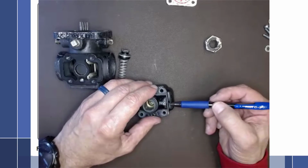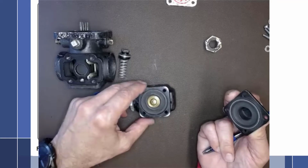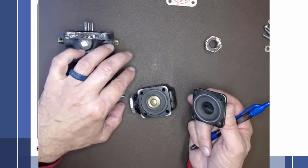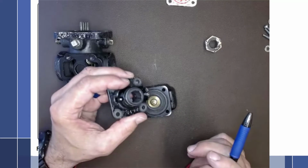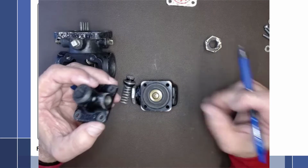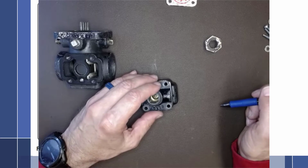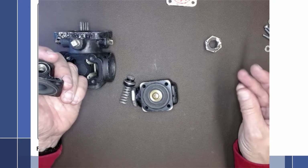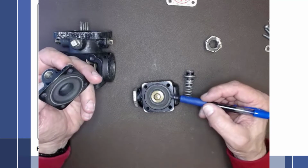If we did not have a vent here and it was capped off, then when I assemble all of this and get an airtight seal in there, the spring and diaphragm would always have to overcome air pressure that has been trapped inside of here. That would not be a good thing, because as we go up in altitude, that would have more of an effect. So by having it vented, when we're at lower altitude, we would have atmospheric pressure at sea level being 29.92 inches or 14.7 psi. That would give us a little bit more pump outlet pressure. And the opposite would be true.